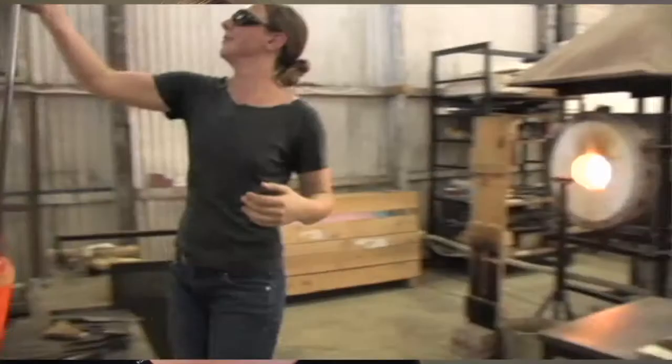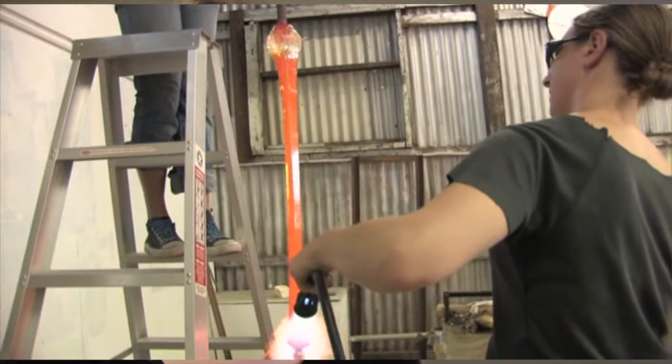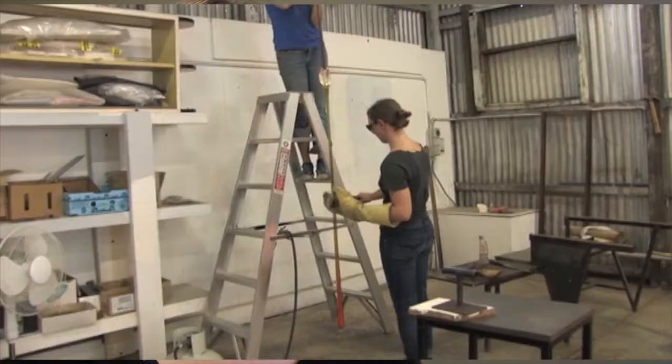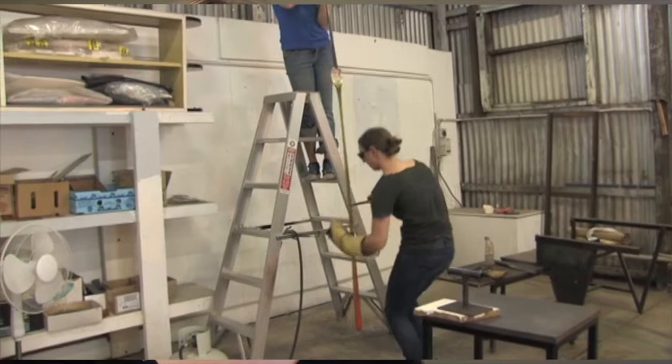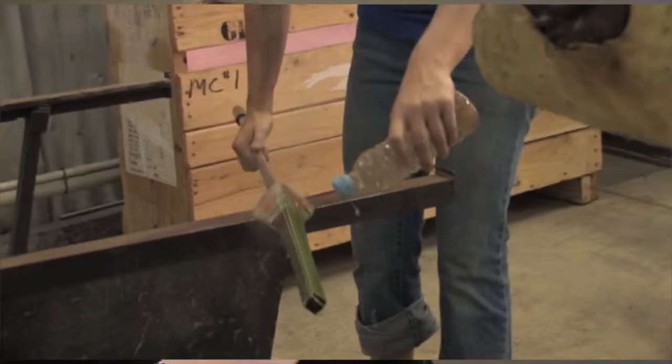Once I've worked on these patterns, I cut it all up and fuse it in open-faced moulds and then carve it and hand-finish it. The hot glass processes I use is just mainly stretching the glass, so I need an assistant and a glory hole. Because I'm working with sheet glass, I don't need a furnace, but I'm heating up the glass in a kiln, then I pick it up, stretch it, give it to my assistant, pop it away in the kiln. So that's the only hot glass processes I'm using.